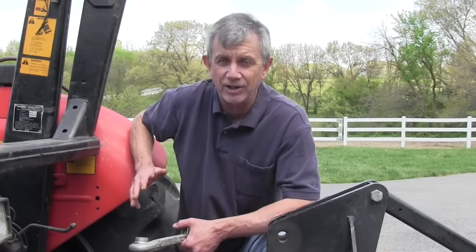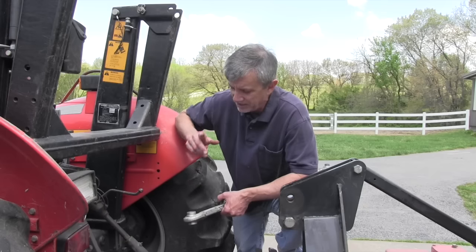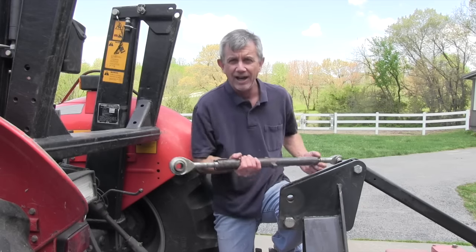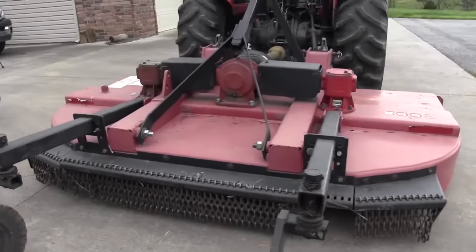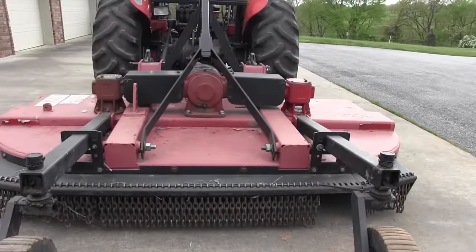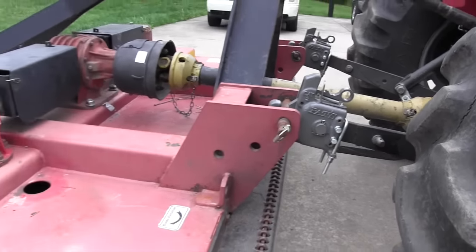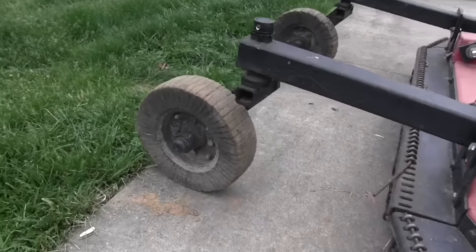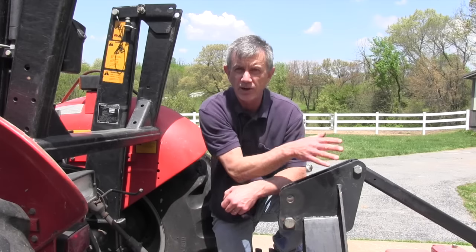The first thing I'm going to tell you is to consult your owner's manual — the implement owner's manual. It'll tell you exactly where to put your top link. The tractor owner's manual won't tell you much. On a three-point mounted cutter, I don't pay that much attention to how long the top link is, and here's why: your pivot points where you're actually riding are on the lower link arms and your tail wheels. So the top link is just kind of going along for the ride — it's there to pick the implement up if you need to get it off the ground.